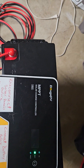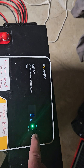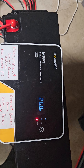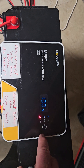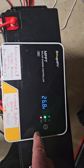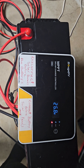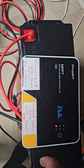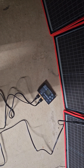I don't have it connected right, so I apologize for that. So it's reading 26, almost 27 volts on this thing — that's for the 24V battery. And then you can scroll through it. There's a temperature reading, and there's also a setting in there for lithium, gel, and different battery types. This one does it all, plus it goes from 12 to 48V. Where most of these controllers, like this little one over here, is only 12V — so it wouldn't work for this big 24V battery.